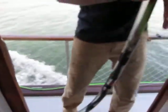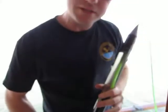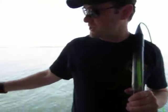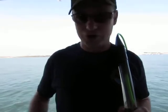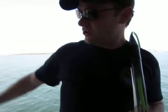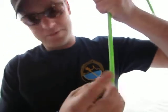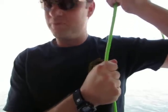So there are two ways that you're going to use this hydrophone array. The one is in a situation like this, when you're driving the boat and you're running, then you'll have it behind the boat. It's designed to be towed through the water. The cable is very strong. It's reinforced with Kevlar inside, so it takes about 2 tons worth of strain to break it. Or a propeller will do it.